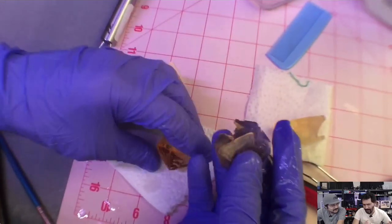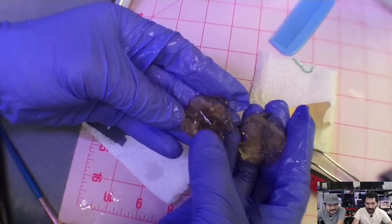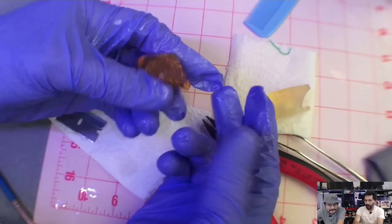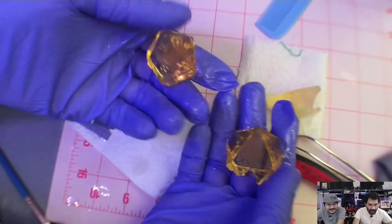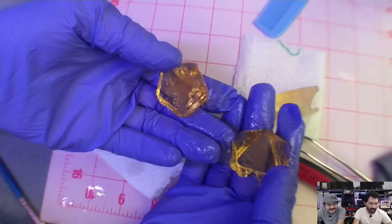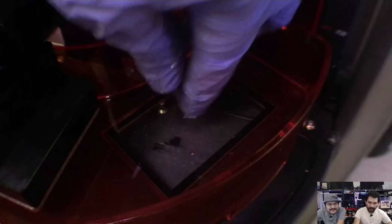I tried different orientations, one at the corner, one completely flat. I tried with supports and without supports, and there's just some things that it can't print. It seems to do a very good job at lattices and, as we're going to show a little bit later, the keyboard caps. It can't print something with such a large area, because it's going to get stuck to the window, maybe from the weight of it swashing around. It's mostly for things like feathers, something orthodontists would probably use.